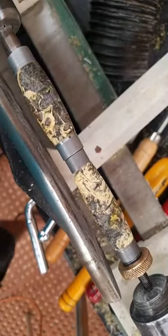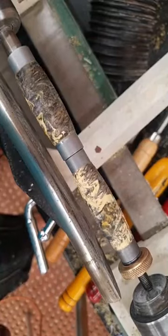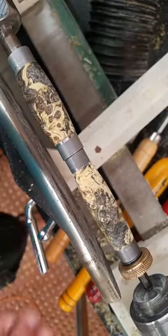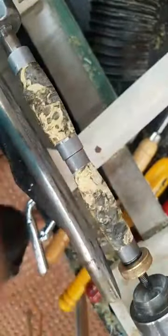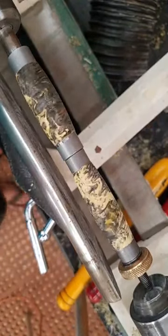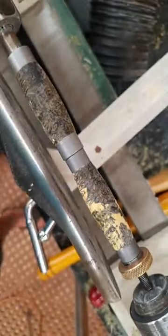So this is where we're sitting, right off of the big roughing gouge. No sanding, no skew yet. Right off the roughing gouge. Pretty dang smooth. We could probably go after it with, I don't know, 240 grit if we wanted to, maybe even 320. But we're gonna smooth down our angles and bevels real quick. Then we'll get to some sanding. I'm gonna go and resharpen my skew real quick. I'll be right back. Sorry.